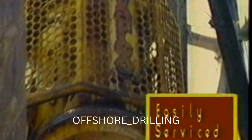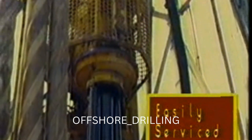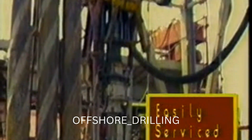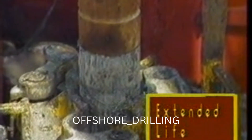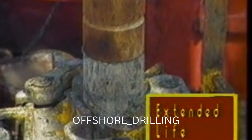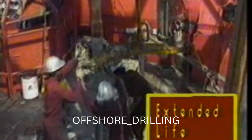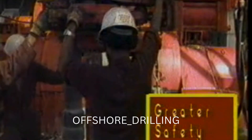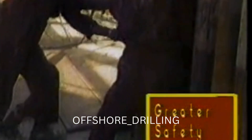Additional efficiency is gained by the ability to rotate both drill pipe and casing through tight spots in the borehole. The system also provides considerable operating economy. Simplicity of design, the use of common oilfield equipment and the availability of parts all contribute to the long-term economy of the system. The precise torque applied to the drill string connections contributes to their expected service life, and the use of the remote Kellycock as a mudsaver valve during connections preserves expensive drilling fluids. Safety of men and equipment is probably the most important advantage. By reducing the number of connections and eliminating several rotating members from the floor while placing the entire operation in the hands of the driller makes a significant contribution to the safety of the rig crew. Rapid and precise response to a kick situation gives the driller the ability to shut in the well and begin his control procedures without critical delay.